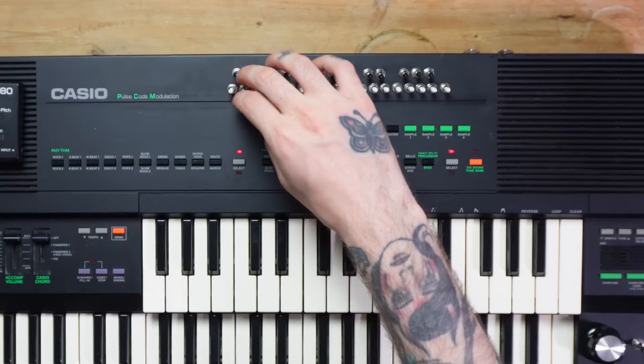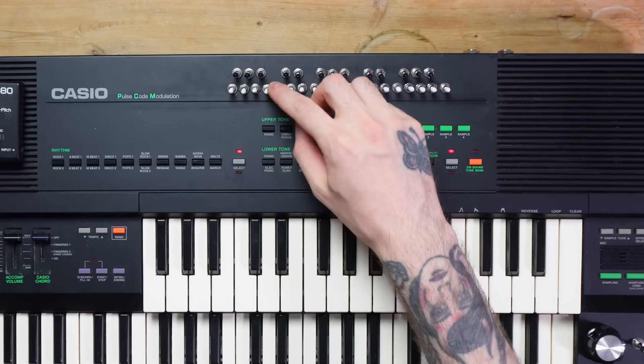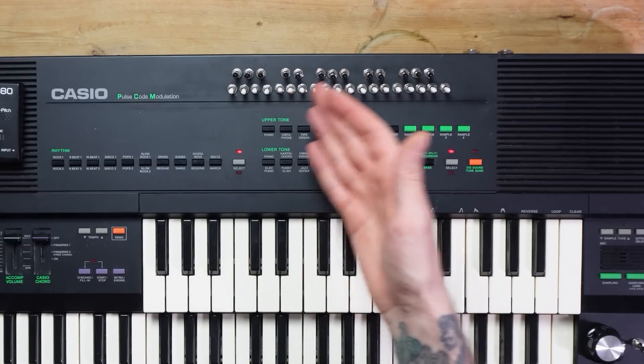What made it take way more time than I thought is that it's all divided by four. These four keys are like these four, but on the inside those four diodes — where the signal goes — go to one jumper. Then these four go to another jumper, like different pathways. So I soldered maybe the first four and the second four and picked which wires to go with, and then it was like — oh, I gotta move that over there. The math with all of these fours was not consistent from this direction at all, so that took a lot of time.